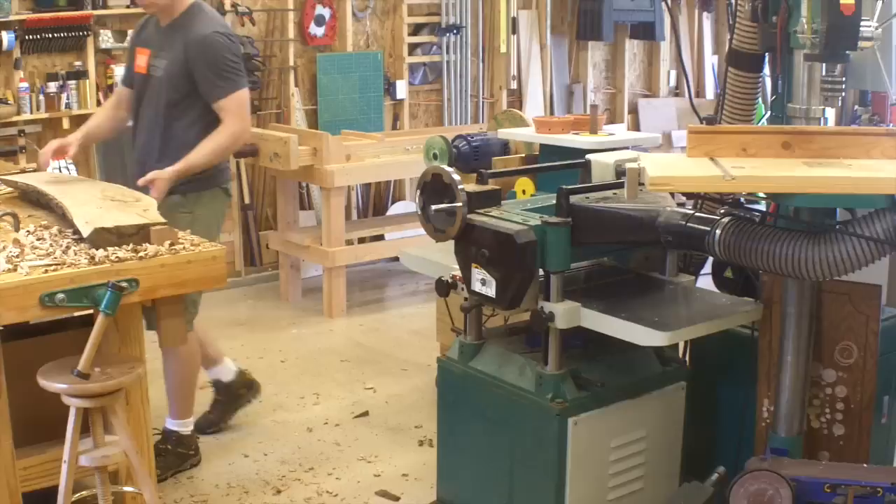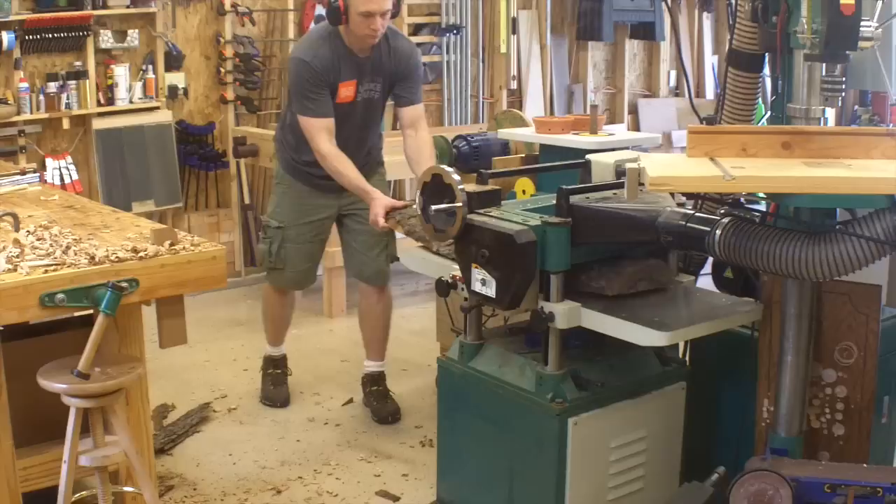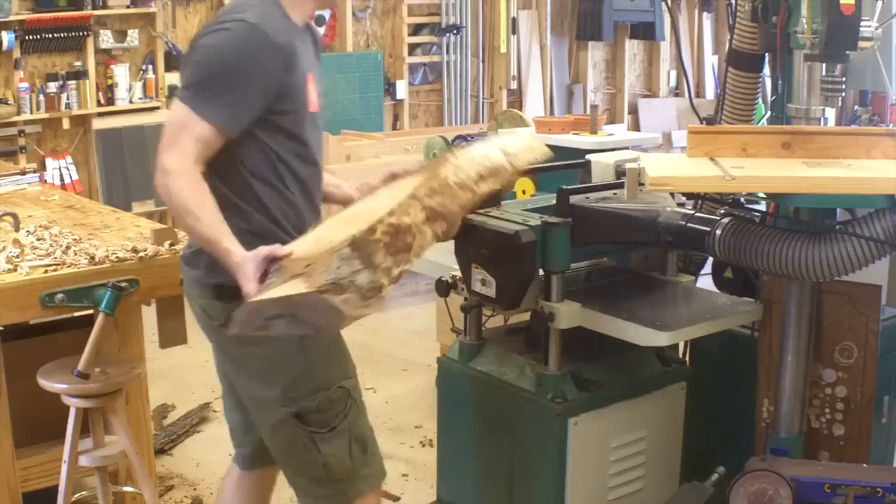But that is good enough to pass through a planer. I know that a planer will translate imperfections in a surface up to the cutter and perpetuate those imperfections, but for the kind of milling marks that a scrub plane leaves, this really doesn't translate up to that cutter. And the fact that there's now no twist on the board means that the cut surface won't have any twist.